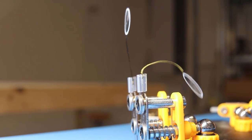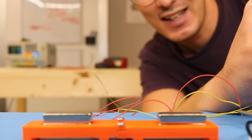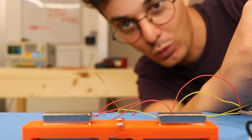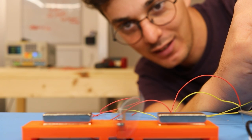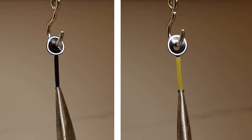I was a little surprised because the speed started dropping for narrower arms. I also noticed a similar behavior when trying to make the arms thinner by removing the solder mask. Anything above 12 Hz made it wiggle, and the single layer of Kapton made it super fragile, so it was kind of useless.